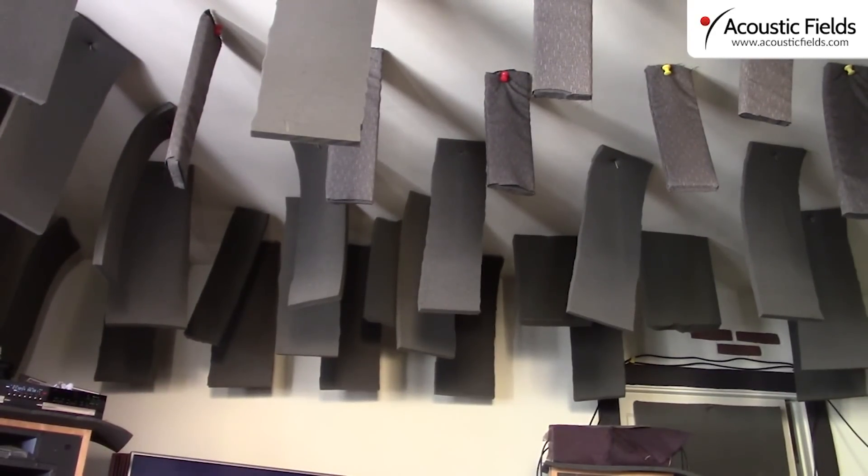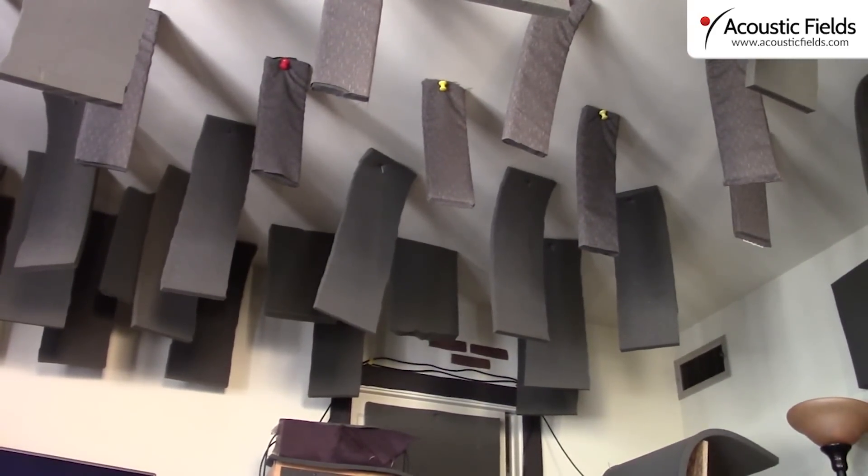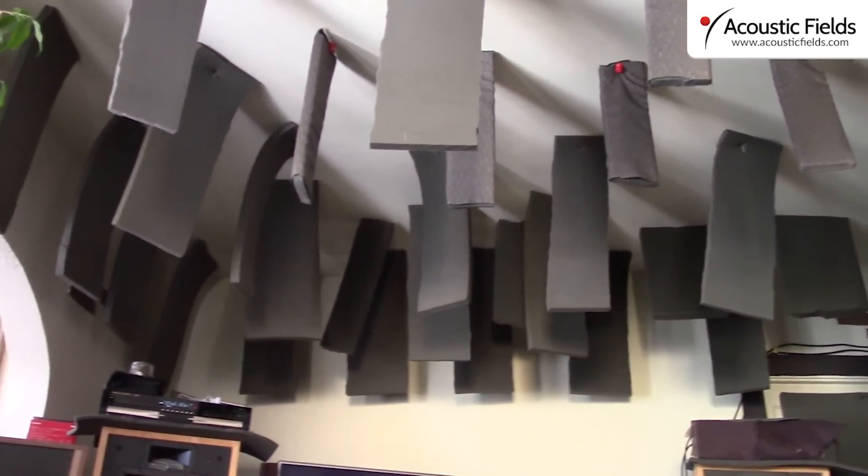One of the things you can do about the ceiling — and I know this is not an ideal situation — is that a lot of people, when they put sound absorption on the ceiling, they attach it flat to the ceiling. That's a good idea if that's your objective, but sometimes in a more open room, in a more open atmosphere, we're not after 100% absorption on any surface area. But we don't want to go so far as to do diffusion, because it's awfully expensive. So the next best solution is to alternate your absorption in a way that adds reflections into the equation.